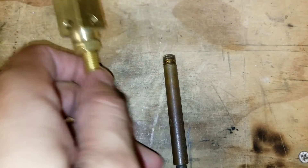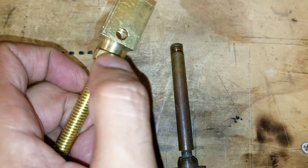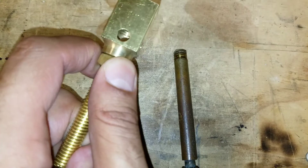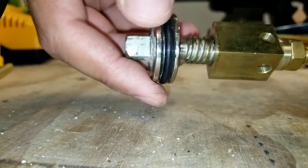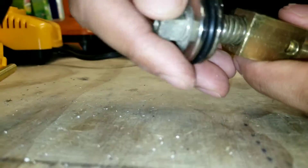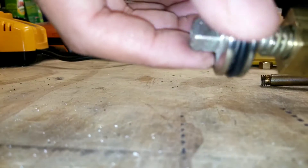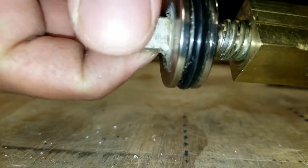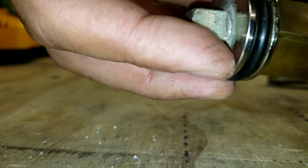Another thing: if you cut your rod a little longer, you can adjust with the nut. As you see, I put the nut behind that end, and you can adjust how much you want it to go in and out. I have a bit of a hard time putting that in. Note that it's counter-clockwise to tighten it — it's not the regular direction. When you go counter-clockwise it tightens; when you go clockwise it loosens. It's backward, so make sure you do that correctly.